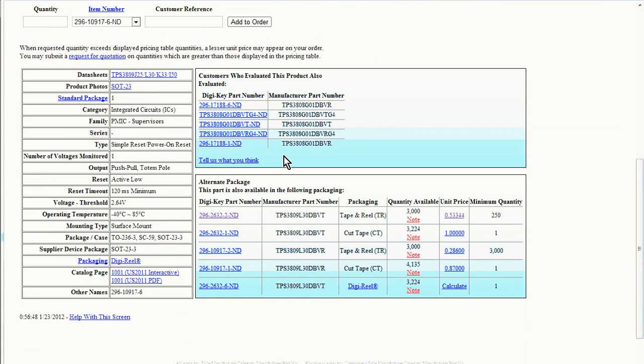And I would do exactly the same step for every item in my bill of materials. Thankfully the microcurrent doesn't have many parts in the BOM, so it shouldn't take me too long. But I've got to go through and order all these things on reels or tubes — preferably reels for everything. I might have to buy more than what I need, so I've got to absorb that cost and hopefully sell enough units in the end. That's the trade-off with machine pick-and-place assembly. Whereas previously I'd order exactly 50 parts, 50 boards, there'd be practically zero wastage from my hand assembler Vootronics.